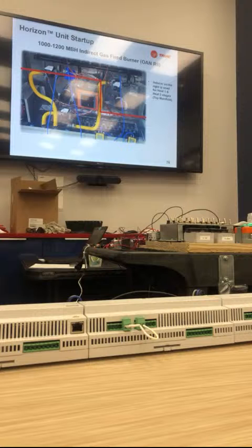Again, we're going to be building two of these a day come next summer. They go up to 80 tons, 25,000 CFM, and 20 horsepower motors with 25-inch wheels. They're monsters. You guys putting compressors right for these? When you asked, I was thinking that all compressors on the OA and Drive 6 are on the bottom shelf. The heater actually is turned. It's almost vertical.